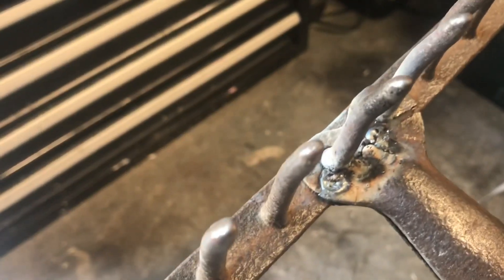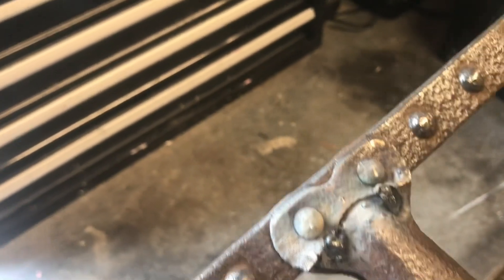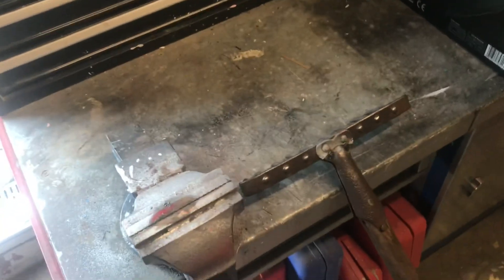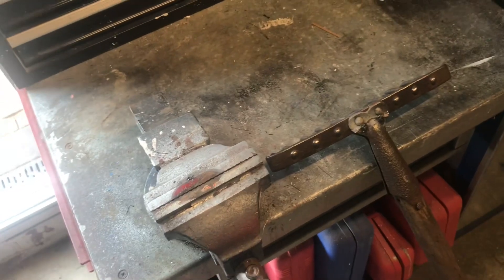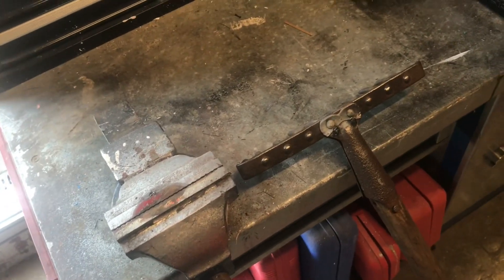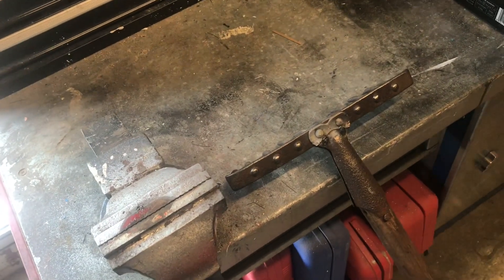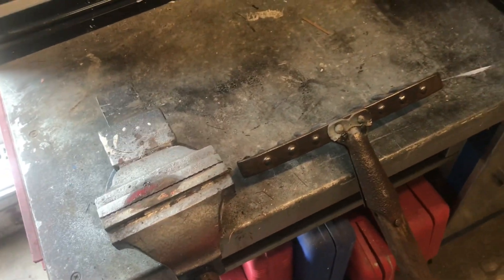It ain't perfect, it's far from it. That one ain't too bad, that one's pretty bad. Those two — well, it holds it together. Probably need to grind it down. But yeah, I've officially welded it. It wasn't too difficult. Having the right gear makes everything so much easier. YouTube videos I've seen make it look more volatile than it actually is when you're next to it and doing it. You've got the goggles, you've got the gloves — make sure your ground's really, really good, so make sure you grind back to bare metal. I've officially welded — it ain't too difficult, but obviously it depends on what you're doing.